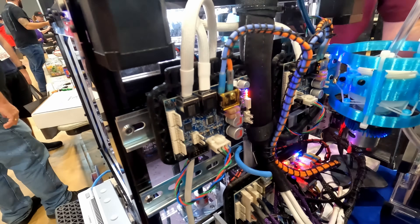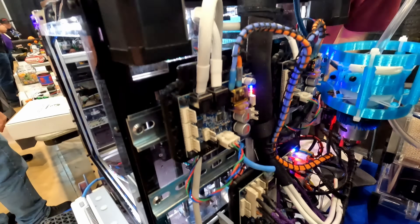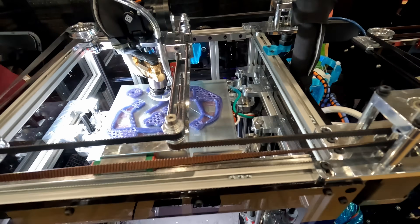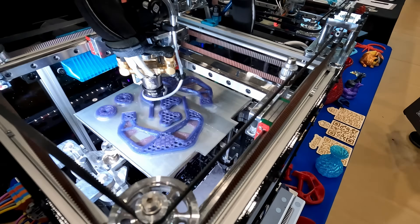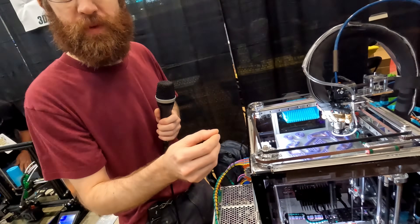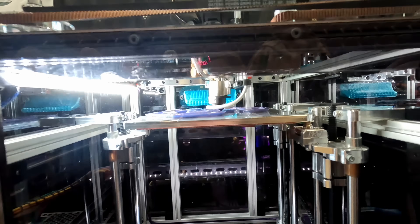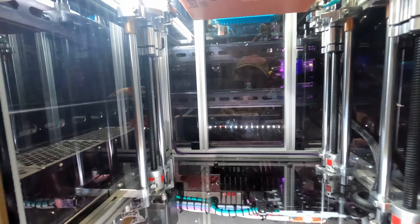It's all CAN bus, and that's where the 48-volt power supply comes in — the motors are running at 48 volts right now. The Z is currently at 24 volts but I'm going to put those on 48 as well. A lot of this hardware is from Mandala Rose Works and 713 Maker. I've polished all these parts by hand, and on the X carriage plate specifically, because of the rail tolerances, I've lapped those flat to within 3 micron to hit higher accelerations. For the bed, it's Mic 6 with a heater pad — a magnetic bed from Subtle Designs, running Wham Bam PEX.